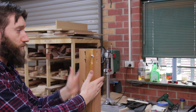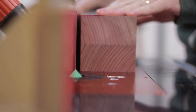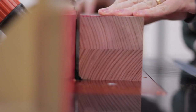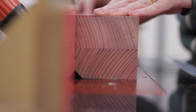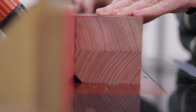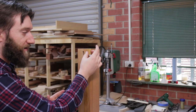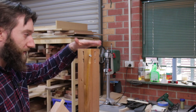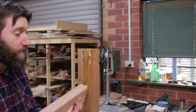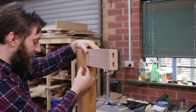The first step is to make your leg the correct dimensions — width and length. Then you need to make a flat area so that we can drill the hole for the hanger bolt. I did this using the router table with a 45-degree chamfer bit. Because my chamfer bit is a quarter-inch shank, I did this in two passes; if you've got a half-inch shank you could probably do it in one. One thing to pay attention to is the width of the chamfer — it doesn't have to be particularly large depending on the thickness of your leg, apron thickness, and apron position.